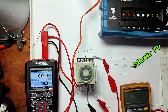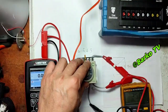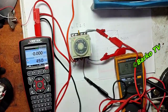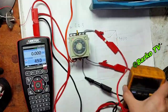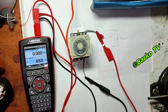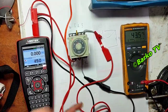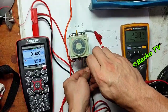Okay, we need to connect — terminals 1, 2, and 3 are already connected. You need the calibrator to simulate this temperature controller. You can also check on Google for the PT100 table, which is the conversion chart for temperature to resistance values.